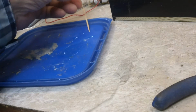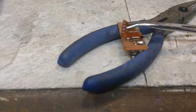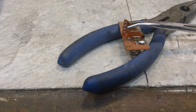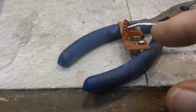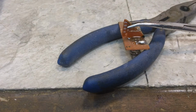So anyway, like I say, that stuff says it bonds to many plastics. Well, this is one of the plastics it doesn't bond to. So that makes a good mixing tray that way. So anywho, I'm gonna let that set up now, and I think it will be good once it sets up. I haven't looked at the back side, but what I did was put a good gob of the epoxy on the battery thing, and then I put some on the gusset as well, so it should be spread out pretty good. And if it's not, then I'll go ahead and make up another little batch and put some more in there to make sure it stays that way.